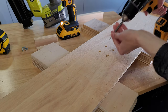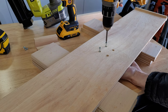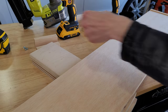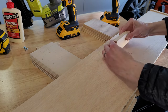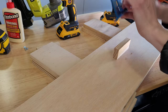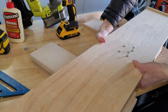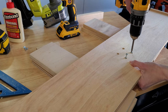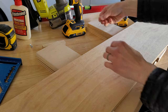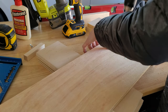I went as deep as I needed to go for the screws I had on hand — I happened to have some rounded-top screws, but if you have flat head, just make sure you do the countersink so you don't have metal that can scratch your tub. I screwed in a few and popped out the tip so I could line up the back of the stand. Make sure it's level, it's square, and in the location you want. Once it's set, add some wood glue, press it in, and attach your screws. Before you do both screws, use a level just to make sure it's set and ready to go.